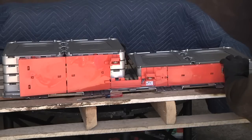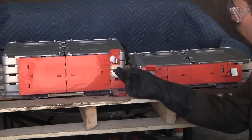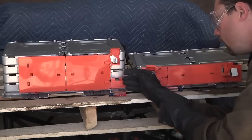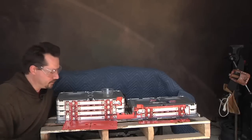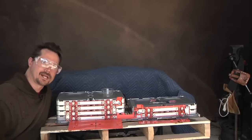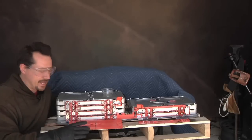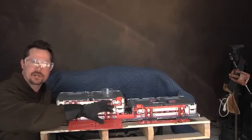You basically have to go around the edges and find where all these pieces snap together. A hook tool works pretty well for terminals that are hard to reach — you almost have to pry from behind — just be careful not to touch any terminals. Once the plastic covers are off, you take out the bolts — these are 10 millimeter bolts — and then the screws on the center BMS terminal using a Phillips screwdriver. Each cell module has four cells: two in series, two in parallel. Since all the bus bars are connected together with the orange plastic, once all screws and bolts are out, the entire assembly lifts right off.